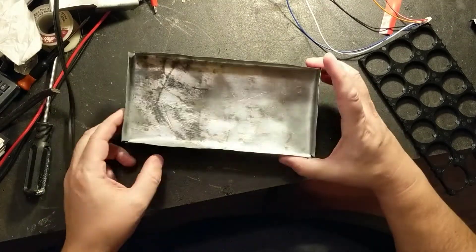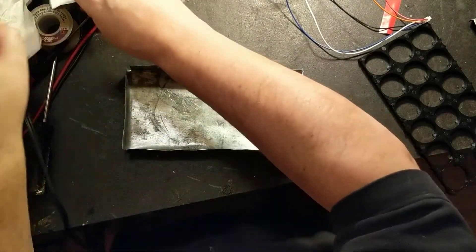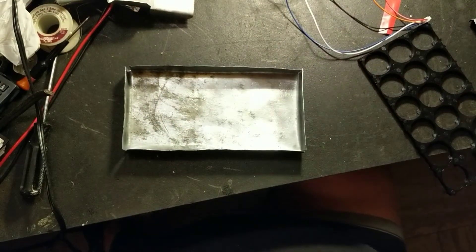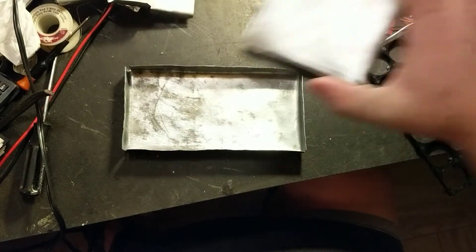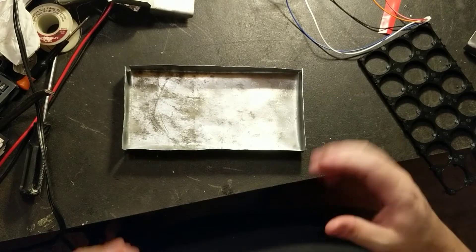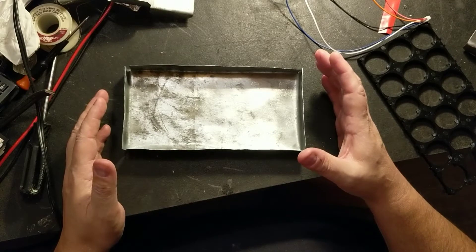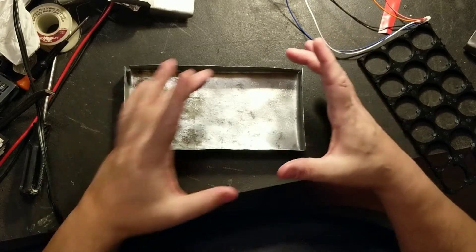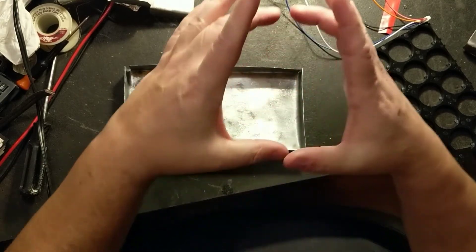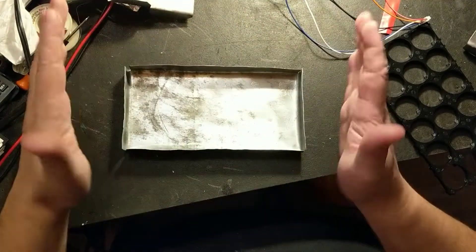What I've done is taken several pieces of sheet metal — intermediate pieces for the stack, and top plates for the positive and negative terminals. I'm going to have 36 cells total. This will be a 4S, 9P configuration — so 36 cells. Each grouping will take up half this size, with 9 cells stacked on top of 9 cells, and then another 9 cells over here stacked on 9 cells.